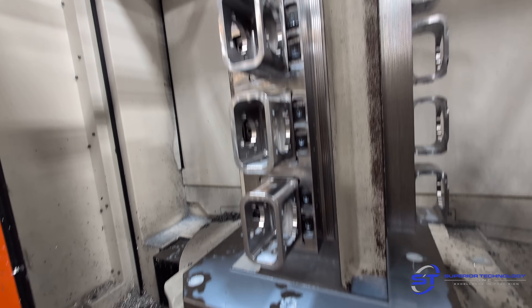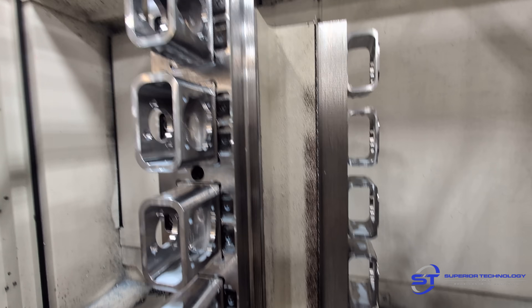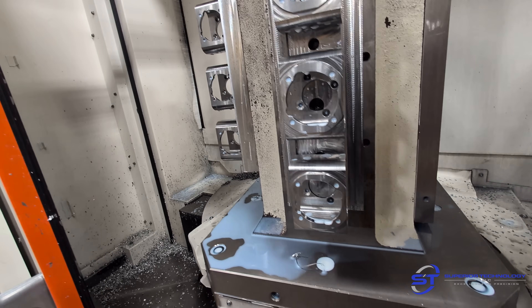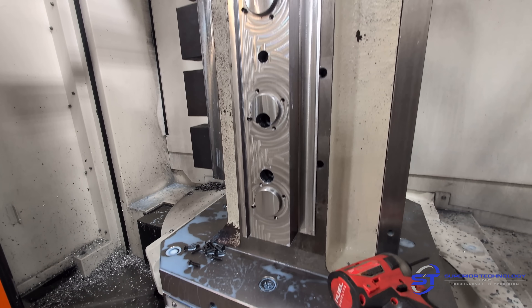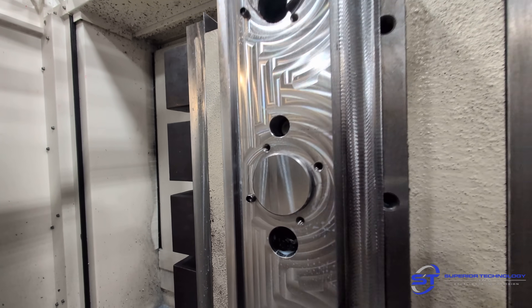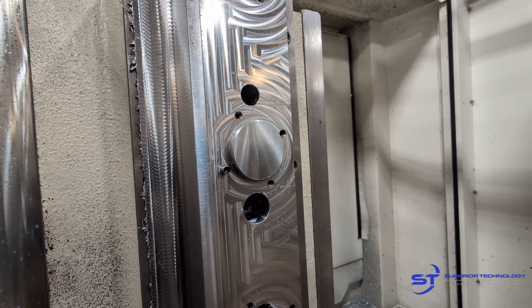This is the OP1 fixture — two talons on each side, a pit bull on the opposite side holding the parts. This is the OP2 fixture. It's just some bosses milled into a 4140 pre-hard plate with some clocking pins and screw holes. The bosses are made about five tenths below the low limit of the bore, and there are the clocking pins.